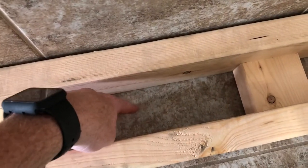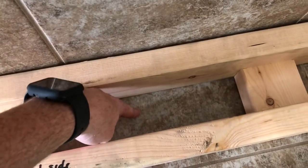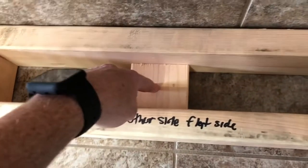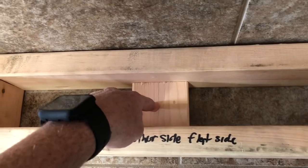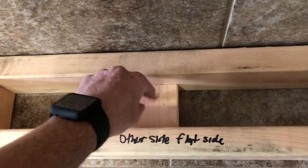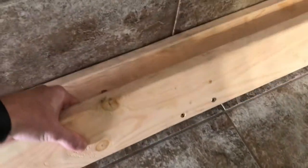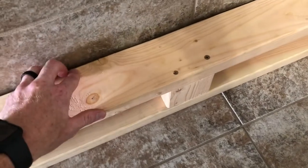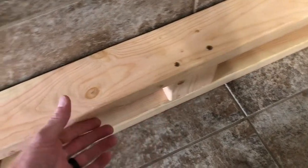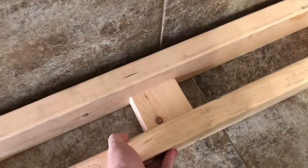In the last one I'll drill a hole in the tile, but not all the way through into the subfloor — just a hole in the tile. Once I have my hole in the tile in the right place, I'll drill a screw or maybe a lag bolt into the floor and then have a washer to keep it secure.